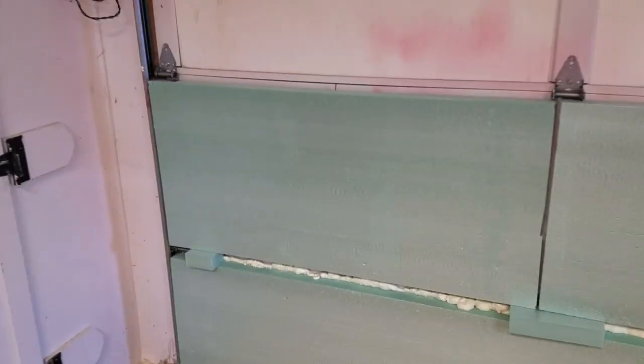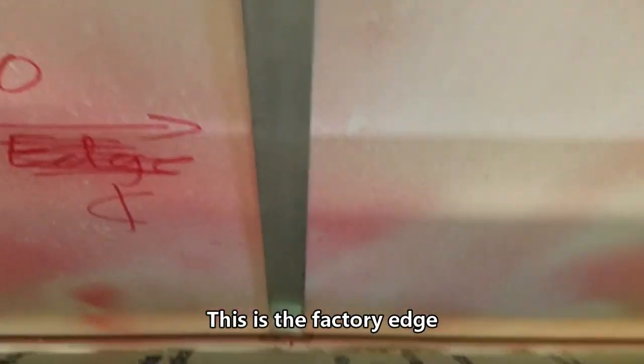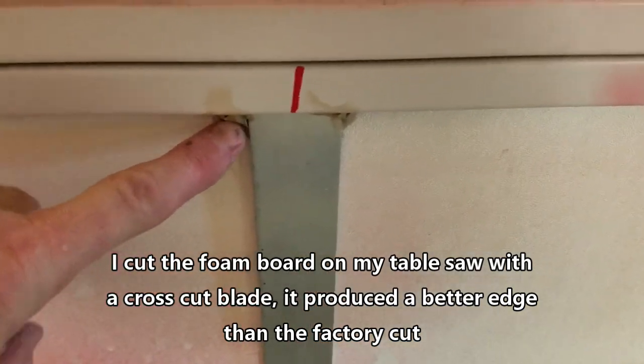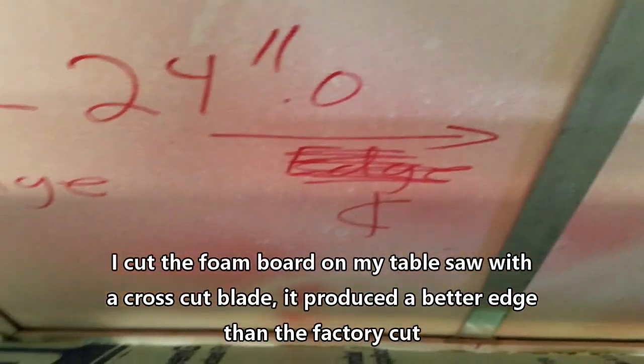Okay guys, I got another panel fit up. It's dry fit right now for spacing and clearance. I've clearanced the rollers. You can see the gap is there where you expect it to be. The big issue with this particular panel set is I have to make sure that this aluminum strap is bonded to the foam well. So I'll put a little extra foam in there. It's secured to the structure with the construction adhesive. That'll stabilize it, make sure it stays where I want. But we'll go ahead and fill her in, get her mounted.